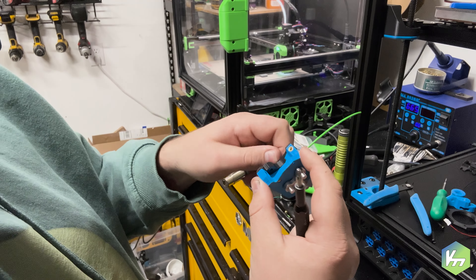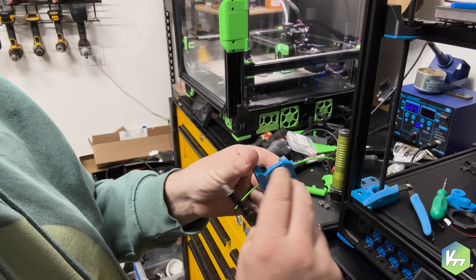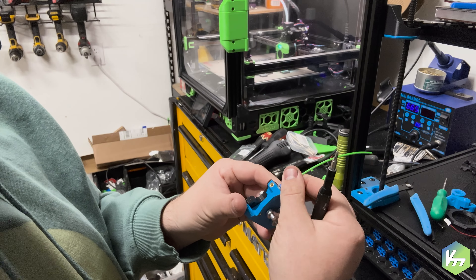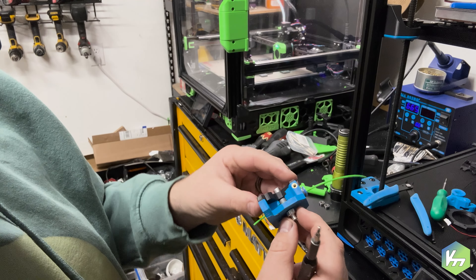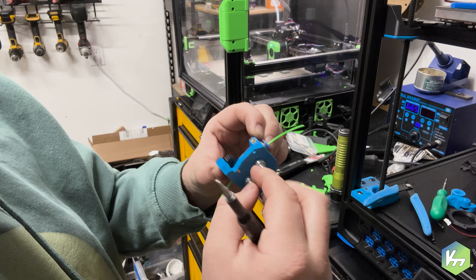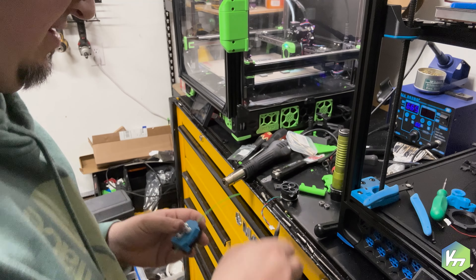Then I'm going to rotate this and see if the filament is coming out with it. You should be able to almost have the filament roll out and then be able to roll it back in with no problem. I'm not touching the filament — I'm just using the gears. You can see it's going in and out. To me, that works. That's going to work great.